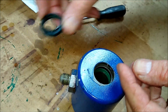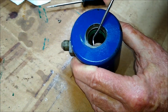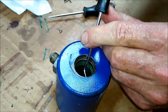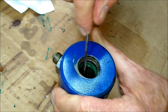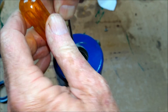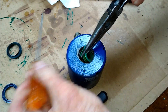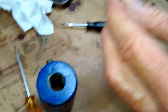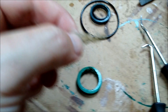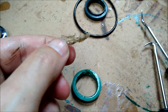The wiper seal looked pretty good — it was not dried or anything. Now the inner packing seal, this green one, is the one that looked rough. If you look closely after we pull this seal out, you'll notice there's a piece of plastic stuck — almost embedded — in the seal. I picked up these little picks from Harbor Freight; they were super handy to get in here to these seals. That plastic piece is what caused the actual failure. After we pull it out with the pliers, you'll see it almost looked like scotch tape, just stuck in the seal.